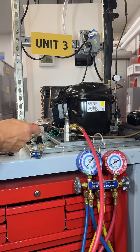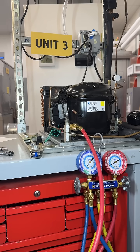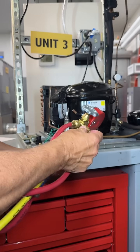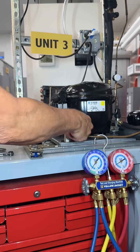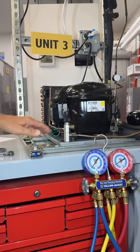I'm going to re-tighten my packing, just snug again. Now I can remove my refrigerant hose, place it back onto my manifold set, replace the caps on my system, clean up any oil that I may have made a mess with, and I'm done.